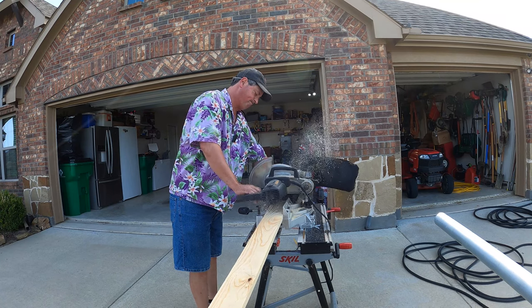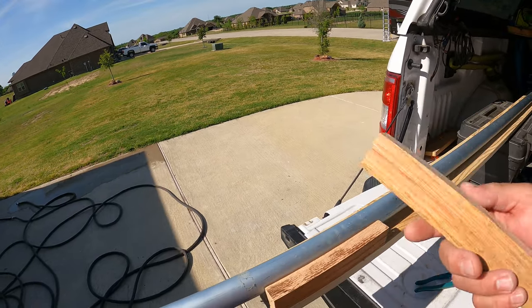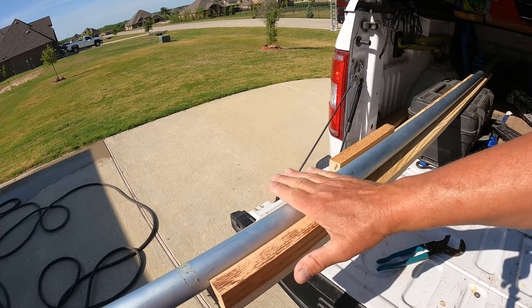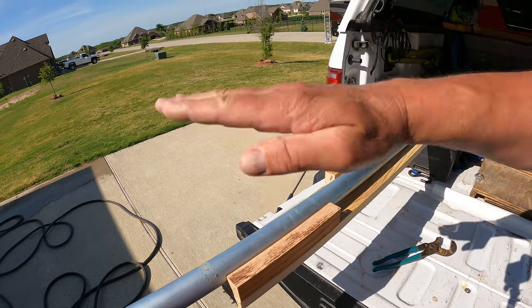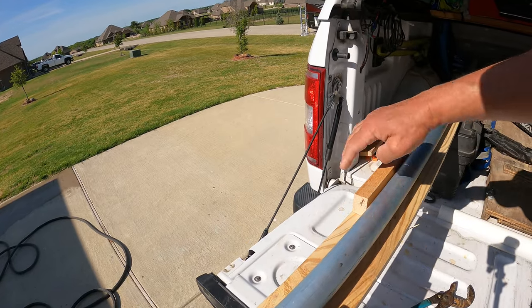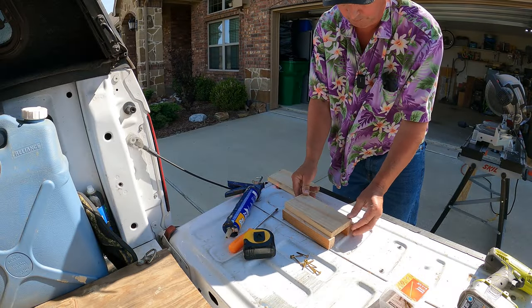Six feet. This is where it gets tricky. I just happen to have some pieces of oak laying around. I'm using treated 1x4 for the riser, and for the lock I'm going to use 1x4 on top of here, and screw and glue the oak blocks to the riser — that way it'll give us lots of strength. Going with a lighter weight wood like pine, we wouldn't have as much strength in this lock. The key is figuring out how far apart to space that — I'll cross that bridge when we get to it.